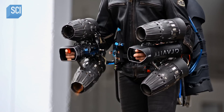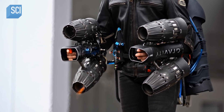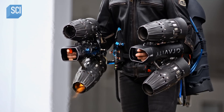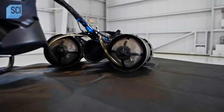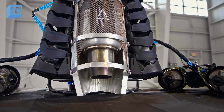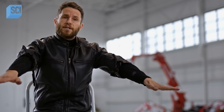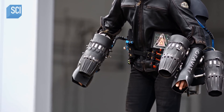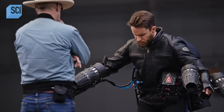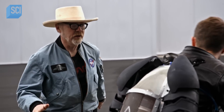Walk me to the basics. We've got a jet suit here which is made up of five jet engines — real micro versions of the gas turbines you have on a jet fighter or an airplane. The arrangement we've ended up with is two on each arm and one round the back. If you imagine that between those five engines they create like three legs of a camera tripod. Rather than controlling the throttle of all of those engines, it's worked really well to do something called vectoring. As you squeeze on the power, you're leaning forward slightly so that rear engine is actually leaning back — that's one leg of your three-legged camera tripod.